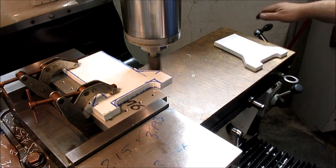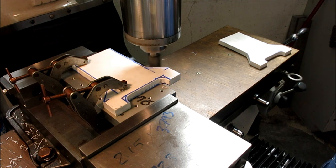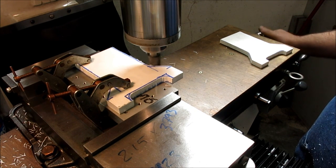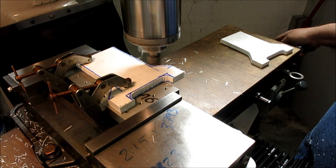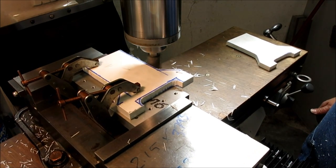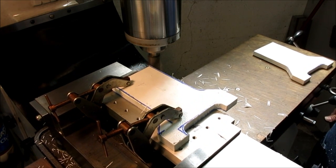Okay. And I know this edge is 1 inch in. And my number is 3 inch 793 to that proper intersection there. Don't get alarmed by the eating into the lines there, because I got plenty of excess there. I'm looking for my X number, which is one inch off of that edge. 6, 7, 8, 9, and 1. Okay, and then heat up nicely here. And this stuff cuts like cream cheese, so it's pretty nice. Okay, so that's one edge nicely done.